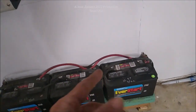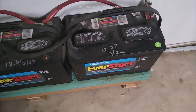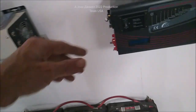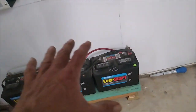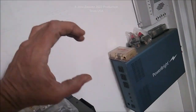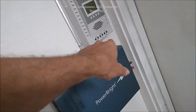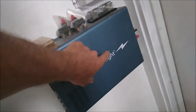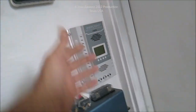We have three batteries sitting in here — those batteries out there are nothing but spares that came out of an RV; they're practically brand new. I just decided to put them down here and link them in. What they'll do is act as power for all my DC lighting. The rest of the batteries come through here with massive three strands of 3-ought wire running back to the main battery bank, and over here it'll be two strands of 2-ought running off the older batteries — the ones that will be easy to replace: only 8 versus 24. That will be running through 8 amorphous 135-watt panels.